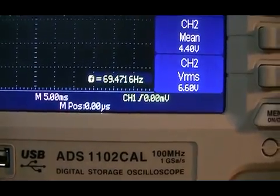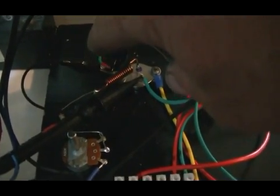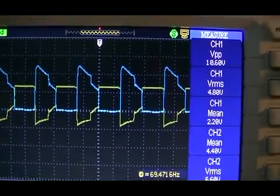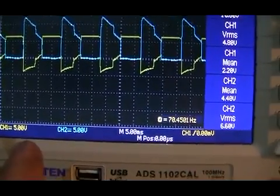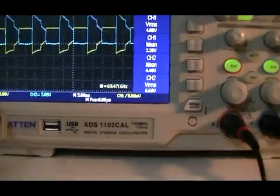At the moment we are only running at 59 to 70 hertz. Scope channel A is hooked across the LED and channel B is hooked across the emitter-collector. Because of the common ground I've had to put the ground on the collector and the probe on the emitter, and I have inverted the blue channel on the scope. It's a pretty stable waveform for a pulse motor, and quite neat. Both channels are on the five volts per division setting and we are on the five millisecond time division setting.